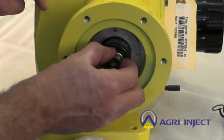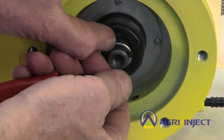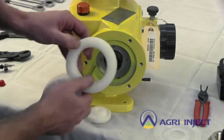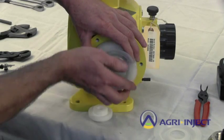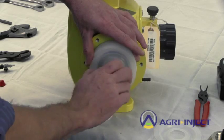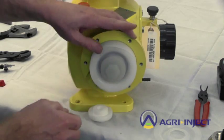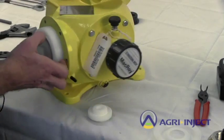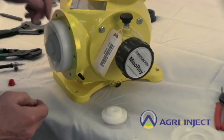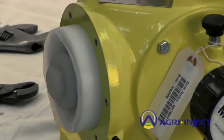Get the inside clamp on the oil seal. Holding the spacer in place, thread the new assembly in. Before we bolt the head on, we need to make sure that there is no gap between the diaphragm and the spacer. To do that, we need to turn the shaft all the way in. Take the motor cover off and just spin the fan.